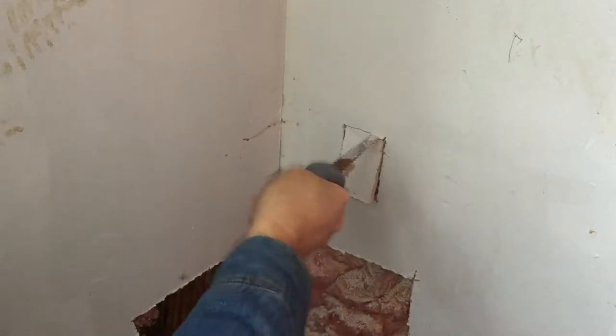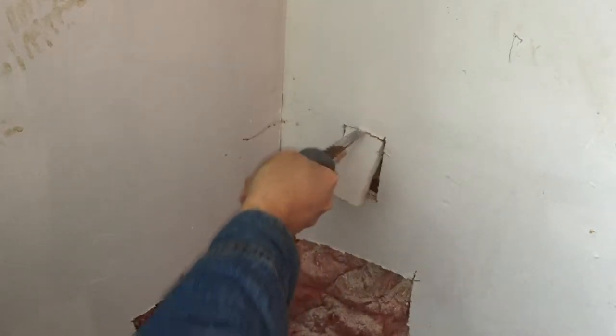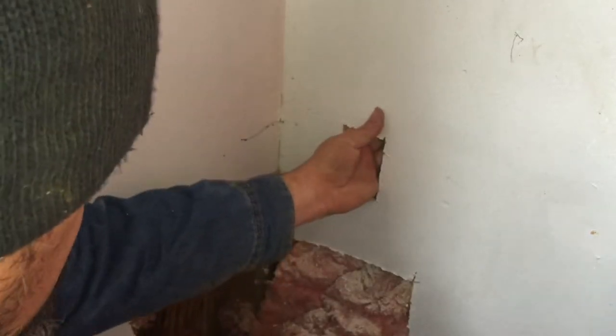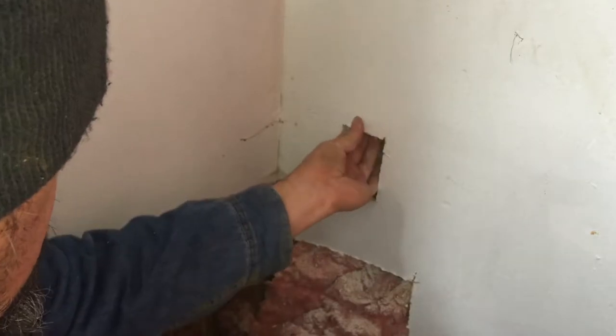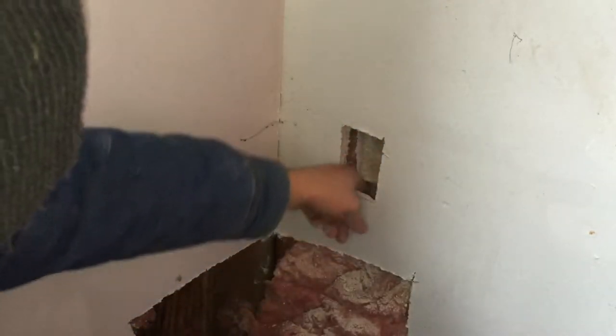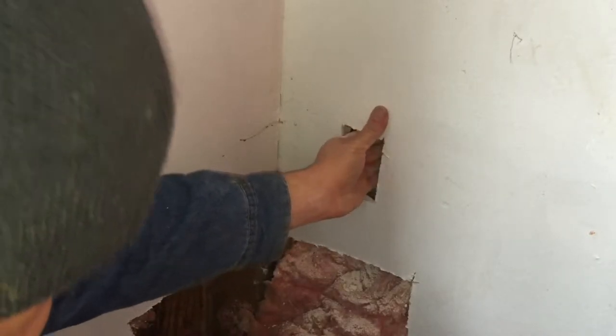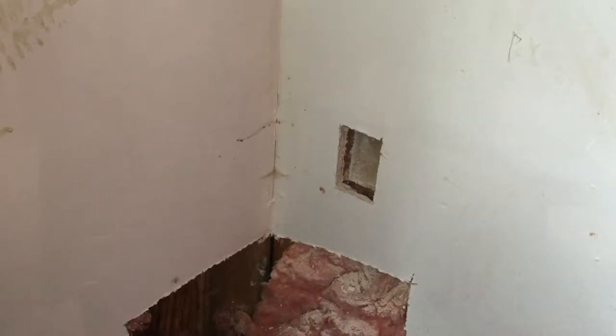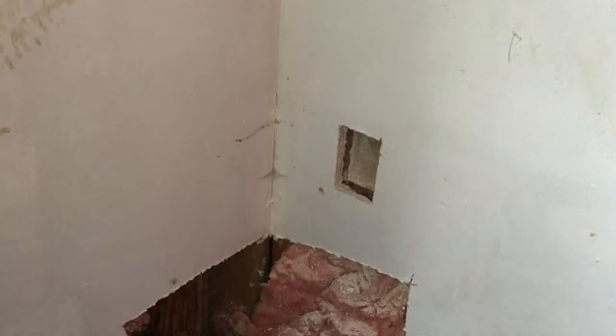When you're cutting holes in drywall, one of the things you learn pretty quickly is never cut behind drywall unless you know for sure what's behind it. If you don't know what's behind it, I definitely would not use power tools like a sawzall or a jigsaw, because in my six years of doing home remodeling, I think three times it caught me and I ended up cutting something behind the drywall. I would have sworn there wasn't anything behind there — and I was wrong.